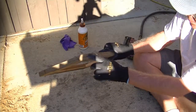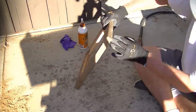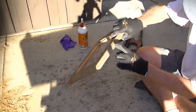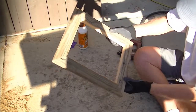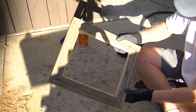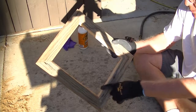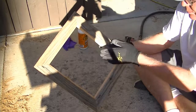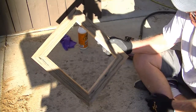The next video I'm going to show, I'm going to fill the nail holes in with wood dough. We'll use a wire brush afterwards because we can't really sand this — we want this to be natural — but we'll be sanding the inside part to get all that off and then finally cleaning them up and staining them in the lacquer room. You can experiment around with the different cuts — you can put that on the outside or the inside. I like to have it on the inside because it kind of points your eye towards the picture part, kind of angled in versus on the outside.